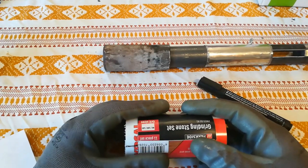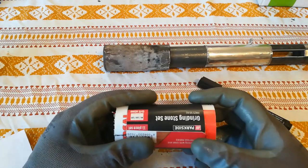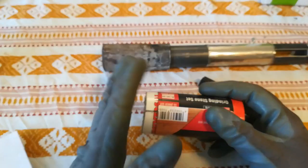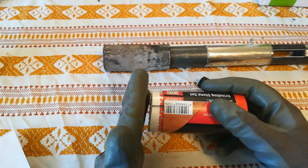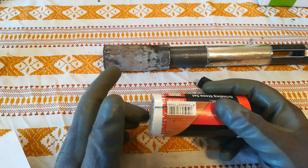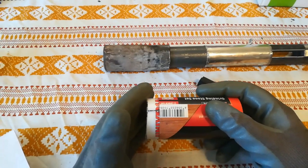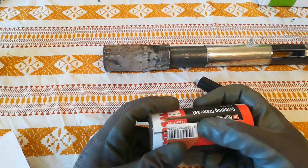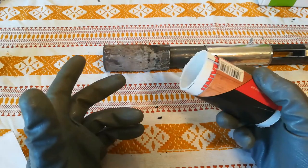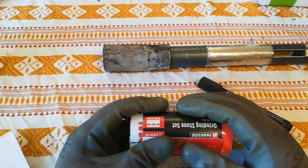Most of the burners that I built use a 10 centimeter long nozzle. I use it that long because once the heat heats up this nozzle it's going to corrode, it's going to oxidize, and slowly it will reduce — it's basically going to rust away. That's why stainless steel is better than water pipe, but water pipes are cheaper and available everywhere.